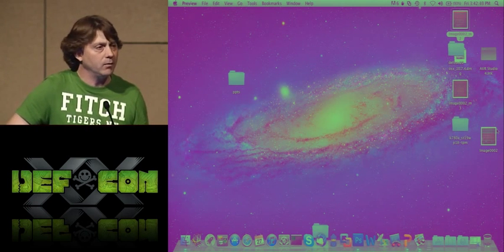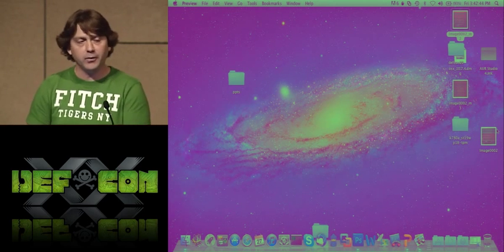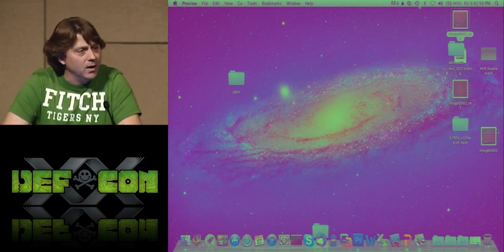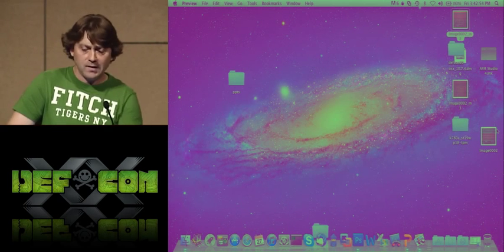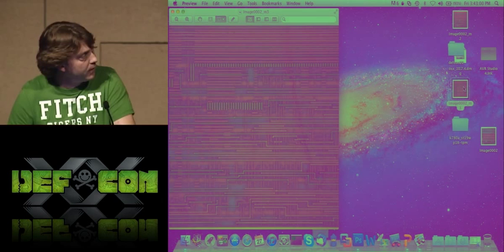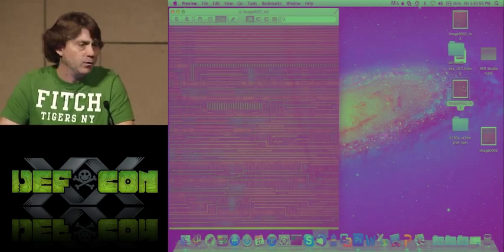It looks real scary when you look at it from a distance. But once you really get in close, polish it down, take all your images, you start to realize there's not much to it. Like, look at there, follow your output, follow your ROM. Or this Atmel here, for example, it only has flash. So follow your flash data bus outputs. What you'll find is it goes through some combinatorial logic, and then it latches into a flip-flop.